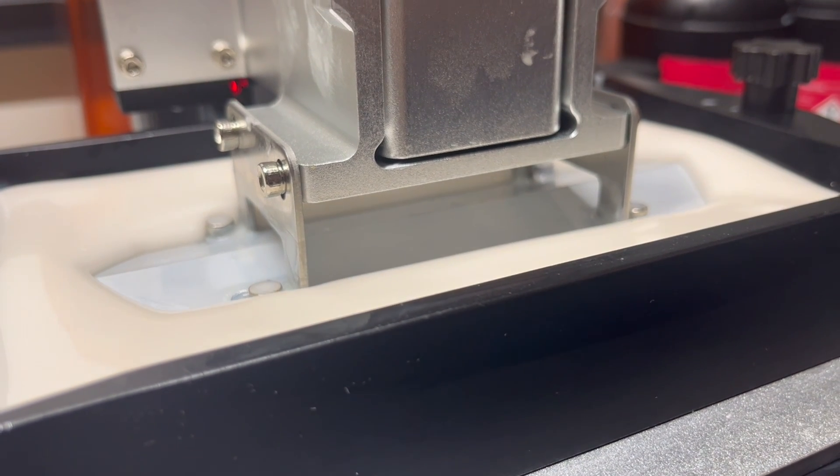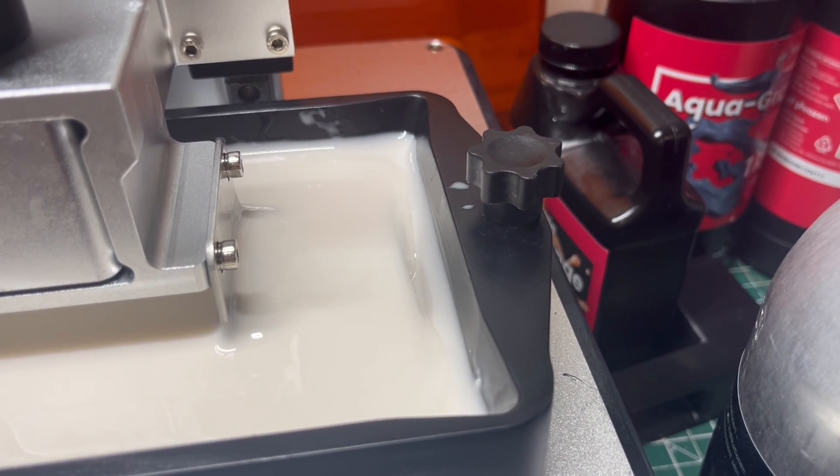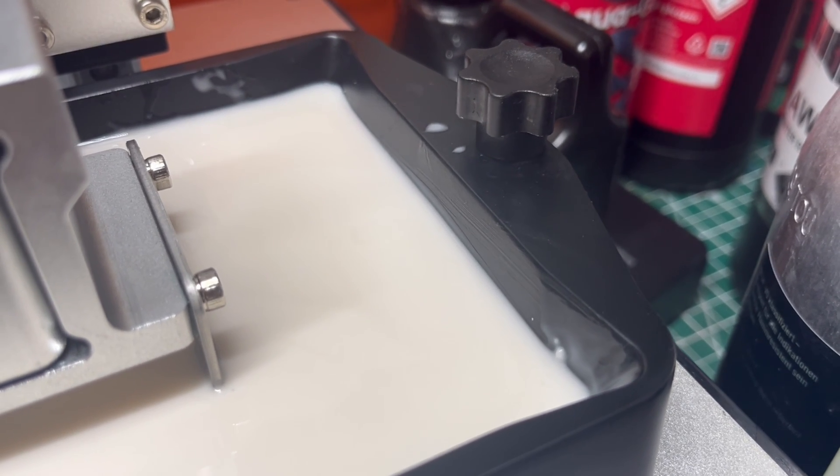The point is we burned through the bottles very quickly — they sent us two bottles and I am now completely out. Another really good use for it would be molds. These particular ones are for RTV molds — they're frames where you put pieces of glass on the side and pour the silicone in the top. If you were to do vulcanized molds with Tyco H, it can stand up to the highest vulcanized rubber temps I've used — 350 Fahrenheit — and you could print your own vulcanized mold frames with debossed logos or custom info. There are endless ways you could customize the molds.